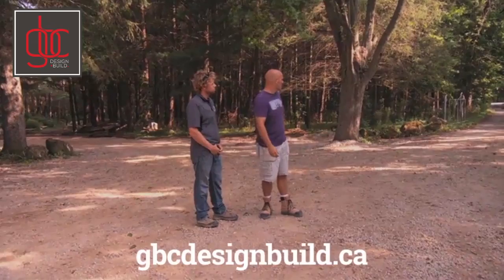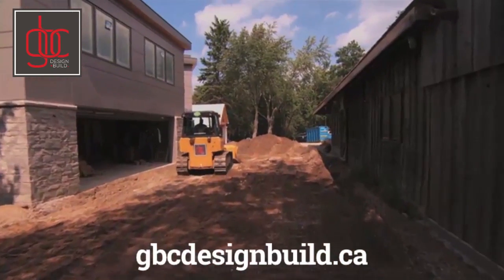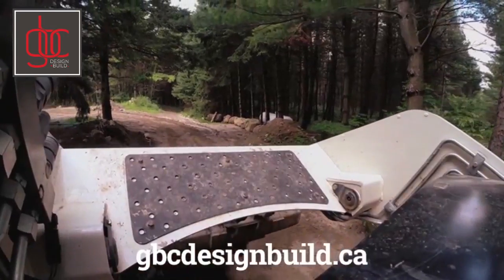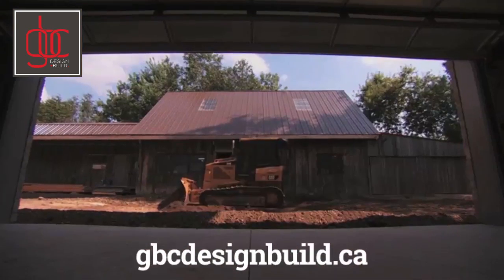All right, let's release the hounds. Because the driveway comes in between the house and the garage and around to the back, we're going to start all landscaping in the back. However, we have to dig everything out and grade it, get everything compacted, so as we work our way out, we're not working in a giant mud pit — everything is solid, and it's not going to sink when we're finished.